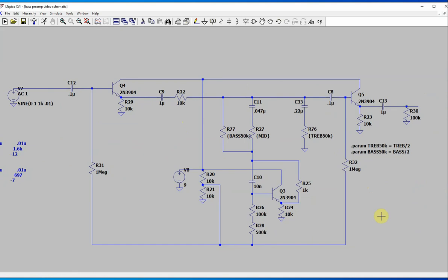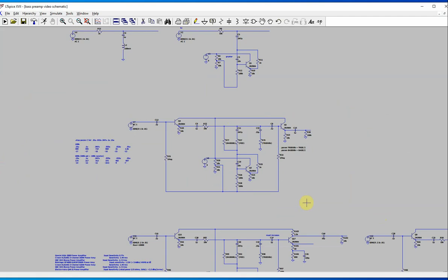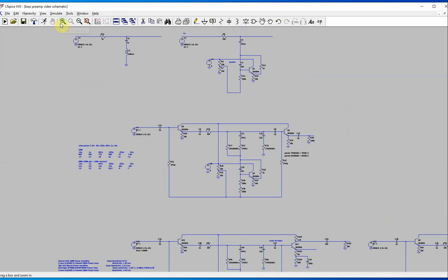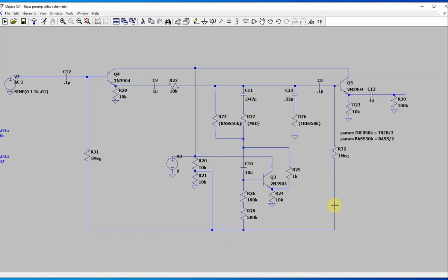So, what did I do? Well, I built the circuit like this, and then I took, what am I doing here? Okay, yeah. So then, I tried different capacitors for the treble, and I also tried different linear potentiometers to see which ones I thought tapered better. Now, logarithmic would be better, but I use linear stuff because I've got shelves full of it. And anyways, this tended to work okay.